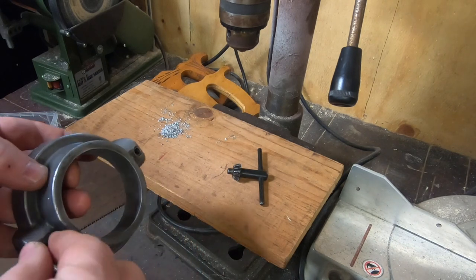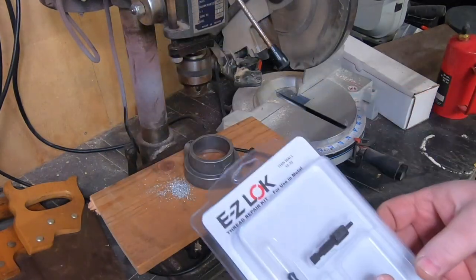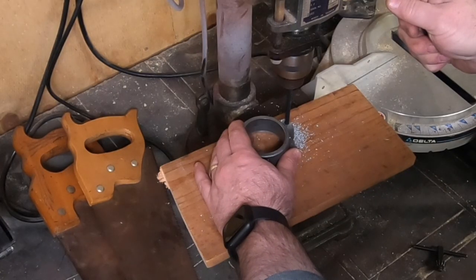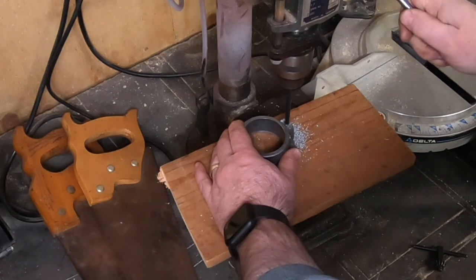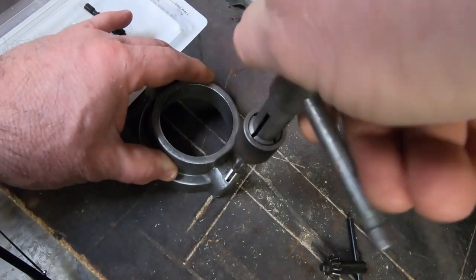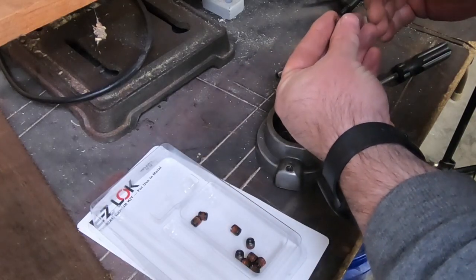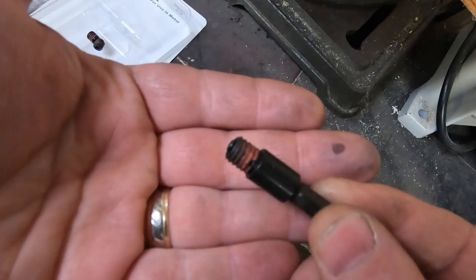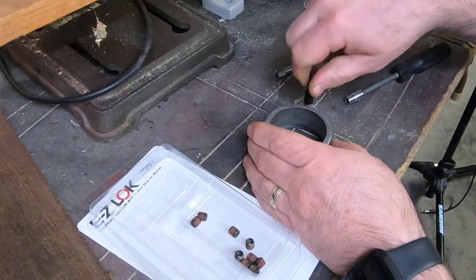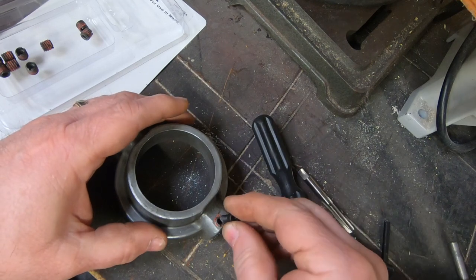One of the repairs I knew I was going to have to make was this threaded hole in the sliding housing for the spindle pulley bearing - it was completely trashed. Rather than spending $55 to replace it, I figured I would just go ahead and fix the threads. These easy-lock inserts are essentially just like a helicoil. The first thing you want to do is drill out the hole and then tap it for an oversized thread. The kit comes with an insertion tool that has a hex driver on the end of it, and the inserts are coated with some kind of thread locking compound. That's a nice easy simple fix.